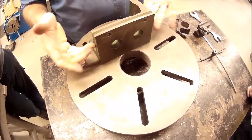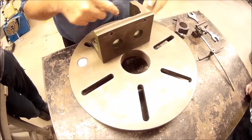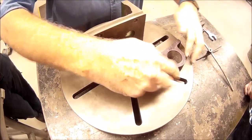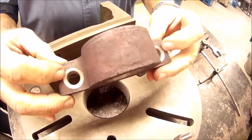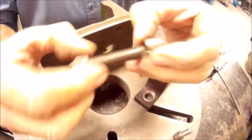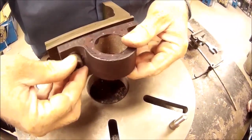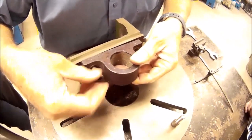So I take my block that I'm going to use to support my jig, my cast iron plumber block, and I put it on the faceplate, gently nip up those bolts. You've already marked out the casting. You machine the holes or drill and machine the spot face, and we use these little locating cones to actually position the casting on the center line of the holes.